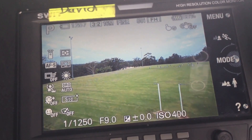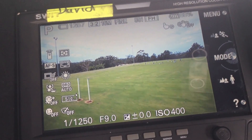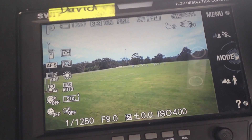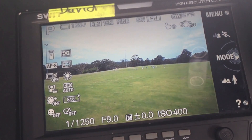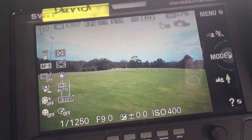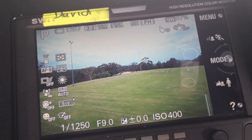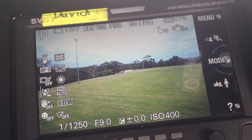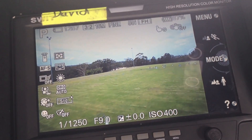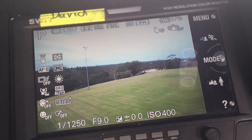We're sending a 15 Mbps H.264 compression. We're sending 1080 at the moment which I think is enough for a broadcast situation. The encoders will go up to 25, probably 30 maxes it out. For wide shots like this you can probably get away with about 10 Mbps quite okay, but at the moment we're sending a 15 Mbps video bit rate here at 1080. We're just going to sit here and I'll keep filming to give you an idea of whether we're getting any breakup or not.